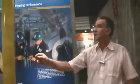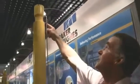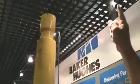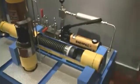Look here on the side. Here is a hydraulic control line going to the shoulder here and into the tool. Normally this control line would go up to surface, but here I have the control line coming down to a small manifold for display purposes.